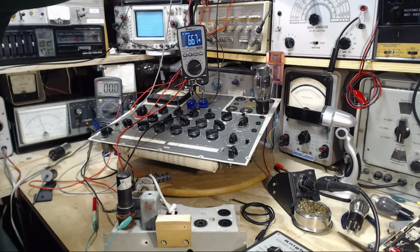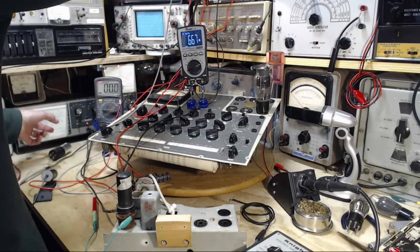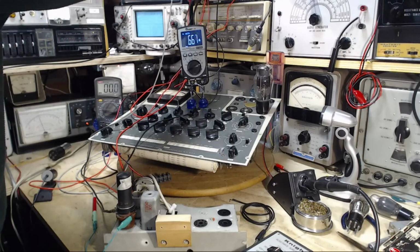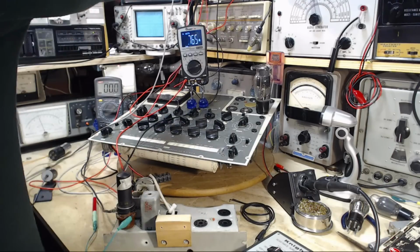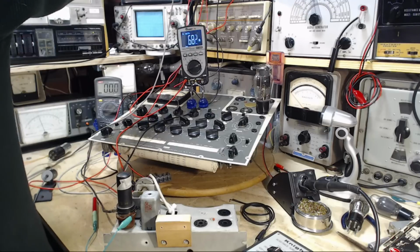And now what if I actually disconnect the power? We'll see what this thing is open circuit. So keeping an eye on this meter. If I don't get in the way of it, I'm just going to break the current flow. Whoa! That was interesting. Now it's almost exactly 6.3, or somewhere certainly in the range. But you can see how much of a voltage drop is being pulled. So at least one of you commented on this problem. And it's very real, isn't it? 5.7.